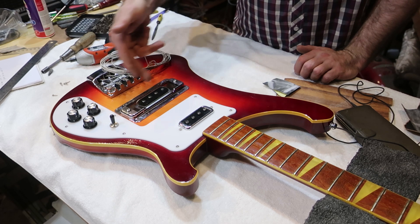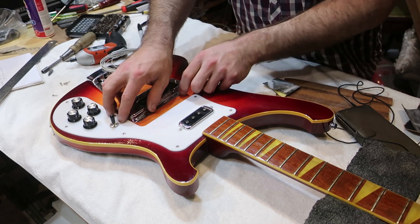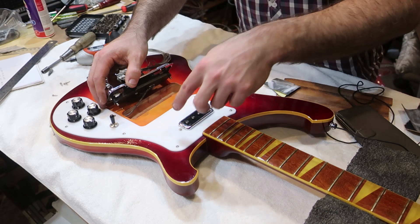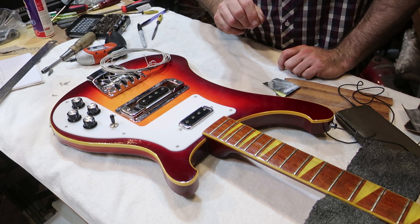I did think of covering the underside with foil tape to give it a chrome look, but I don't think it needs it — it looks fine. What I am going to do with the aluminium foil tape is shield these cavities, because none of this is shielded under here and this bass has in certain circumstances had a pretty mean buzz on it.